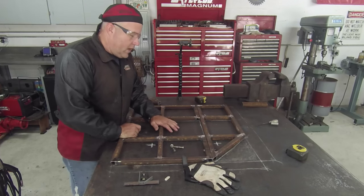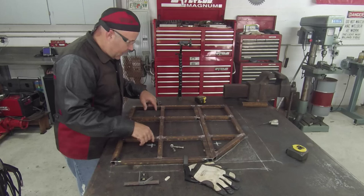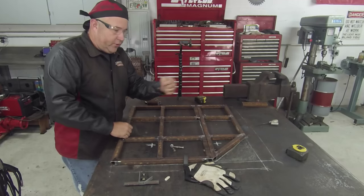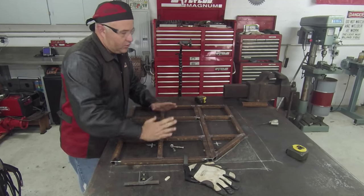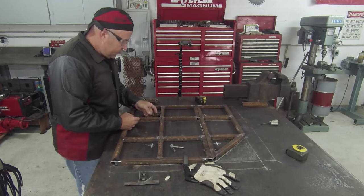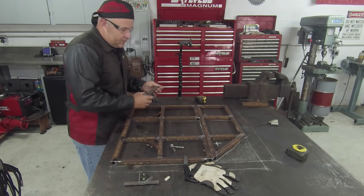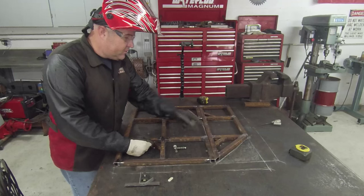I finished welding this up and while off camera I went ahead and ground off the excess reinforcements on the flat sides. I did a lot of thinking trying to figure out how to put a piece of material where I could get a bolt through for the J-bolts that tie this to the windmill tower structure. There are four angle iron pieces that come up, have a hole drilled through, and the J-bolt goes through and comes straight up to the top with a nut — basically just pulls it down into the wedge or pyramid shape. What I came up with was simply to put two miters in and drill a hole right through the center for the J-bolt. The Ellis bandsaw does a really good job cutting those miters — they stay true and square. I've numbered these pieces as to where they go — this one is a 45, 45, and all these pieces are all 45s.